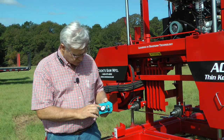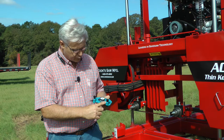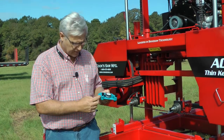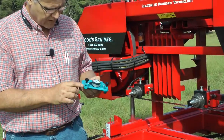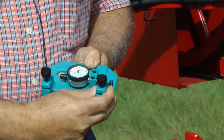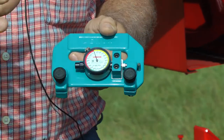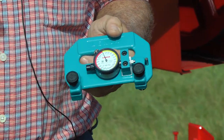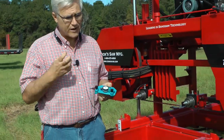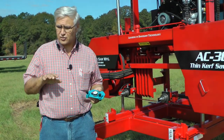When I put it on I want to make sure that it's set on zero. I also want to make sure that I don't push the back of the blade all the way against the back of this meter, because if it does it could bind. I'm just barely wiggling this over here and it can just go around without hardly even wiggling. It needs to be very free — this is like, if you've done machinist work, it's like a dial indicator.